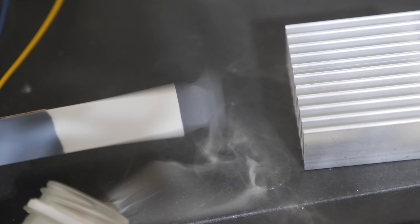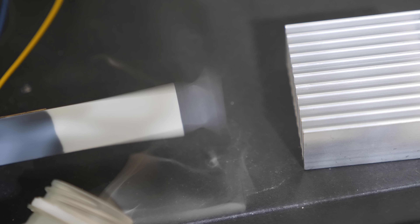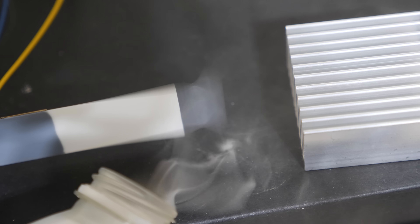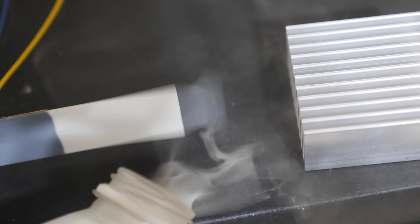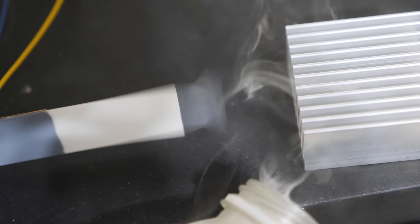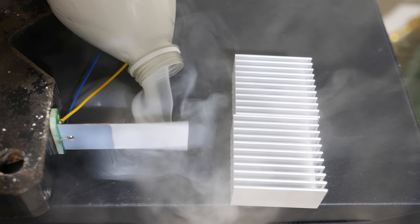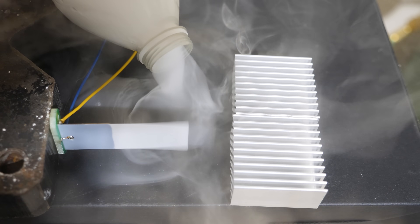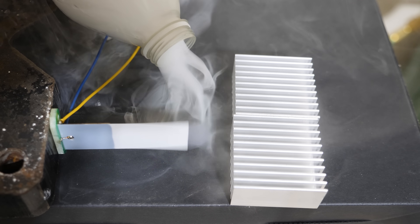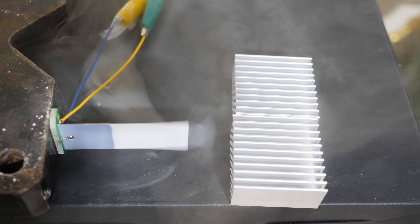What's really cool about this type of fan is that it uses almost no power. It's basically just like a capacitor where you're alternating the voltage on it, so this uses only fractions of a watt of power. Because there's no wearing surfaces, piezoelectric fans like this can last for billions and billions of cycles. In fact, I just saw a video where a guy's been running his piezoelectric fan for over six years straight and it hasn't broken down yet. That's because everything that's moving is well under the elastic limit, there's no friction parts, and so there's nothing really to wear out.